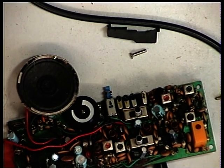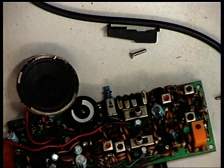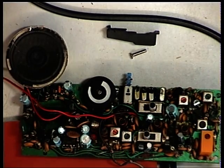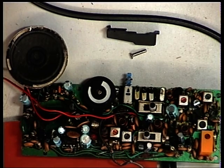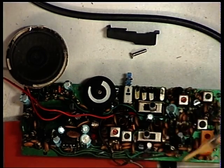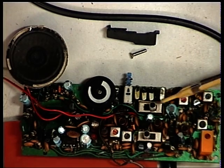I've used service switch cleaner on the preset - variable resistor 2 - and that's brought the deviation up to 2.1 kilohertz, which is within spec but a little bit quieter than what we would have liked. So that's done all the transmit things there are to do on this: it's brought it onto frequency and set the deviation.